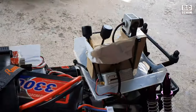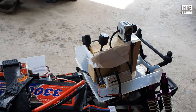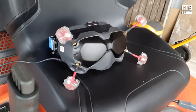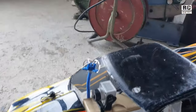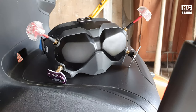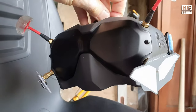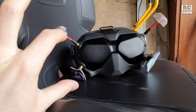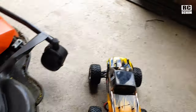So I don't have a polarization mismatch — which will also be a test maybe. And here I have the original DJI air unit antennas which are left-hand polarized. So let's see how the stock antennas work in this environment. Now the polarization mismatch test: four SPVs, right-hand polarized on the goggles, and two lefties — the original DJI. Now we will do SPVs here, and SPV plus patch on the goggles — sticking to what I currently know: patches on the bottom. There was also this theory that patches on one side, top and bottom, are a good combo — patches on top and bottom, and SPVs on the left side. Still SPVs on the car.